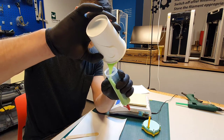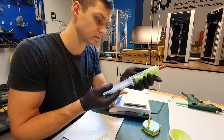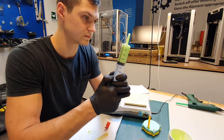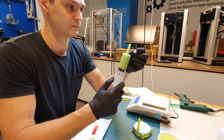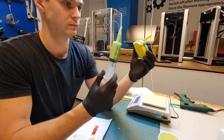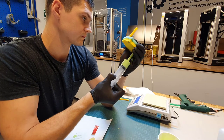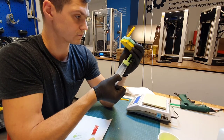Here I fill my syringe and insert the plunger. Then I press until material comes to the tip, letting all of the air out. Then I put a nozzle adapter that fits inside the injection hole. I hold the mold at around a 45-degree angle so that the injection hole is the lowest point and the material escape hole is the highest point. Doing it this way there should be no bubbles getting trapped inside the mold — all of them should come out at the top.